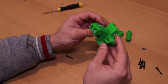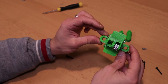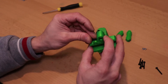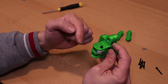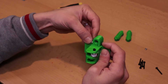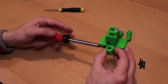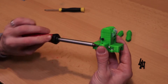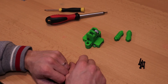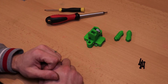Next I'm going to put the M3 bolts through it to secure the X-axis. I'm not going to tighten them down yet, because I want to be able to move the rods to put them in the right position. And done. Next, we're going to do the same thing for the other side, and then we're going to put everything together.